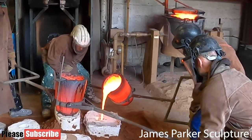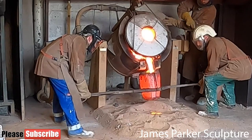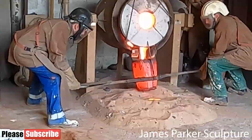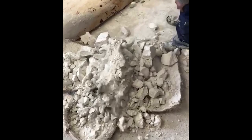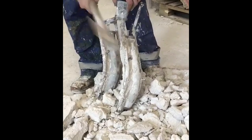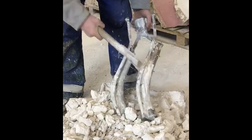The noxious gases escape through the vents. This process is repeated until the investment moulds are full. Two crucibles are being used here so that each pour can be completed without the bronze cooling between pours. When the hot bronze has cooled down it's time to knock out the moulds. Here you can see the vents and ducts attached to the stock — anything which was formed in wax is now present in bronze.